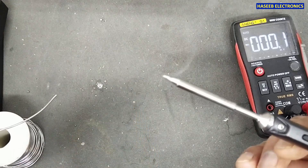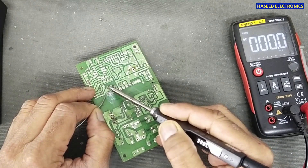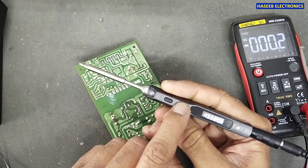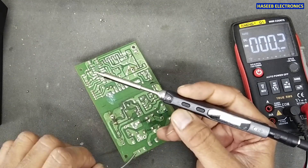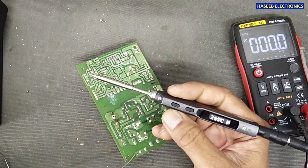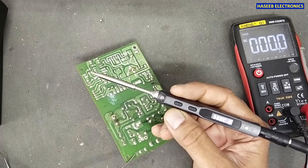Excellent — it has a very fine tip. It is now at 300 degrees centigrade. If I want to increase the temperature, for example to 400 degrees centigrade, we will wait and check.